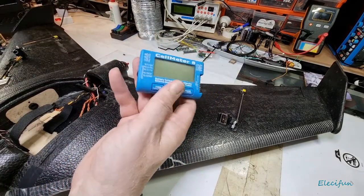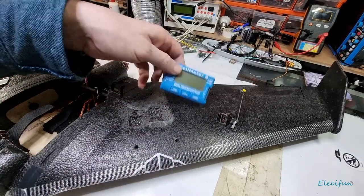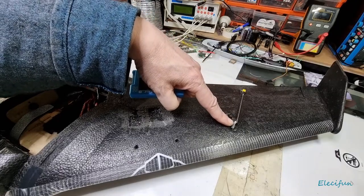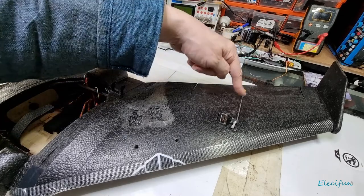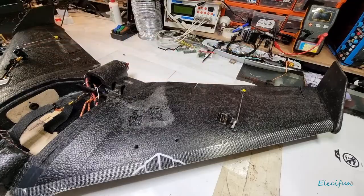So you just set them up so they go to 1500. You're going to 1500, and you're going to make sure that this thing is sticking as close to 90 degrees with this as possible. And the same on the other side. They're not going to be matched absolutely, but that doesn't matter because you've got some adjustment here onto your aileron to make sure you get that straightish.